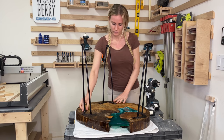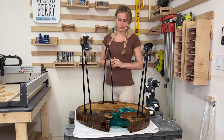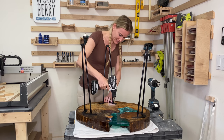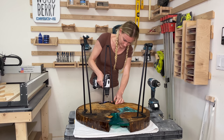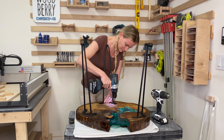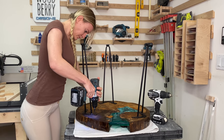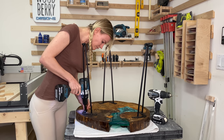After the oil has dried, it's time to attach the legs. The legs I'm using are purchased from Amazon for $37 — they came in a 4-pack. I decided to only use 3 of those. Decide on the best location for the legs and then pre-drill the holes. Once you pre-drill the holes, attach the legs with the supplied screws. Make sure to not over-tighten the screws. Now do the same process with the other two legs: pre-drill the holes and then use the supplied screws to attach the table legs.